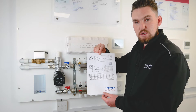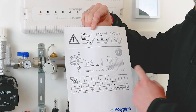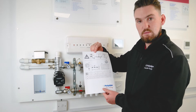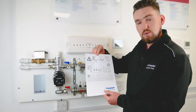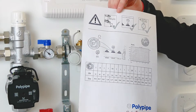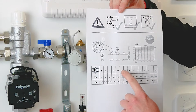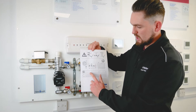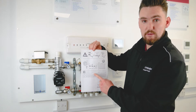On the conversion chart, we've got liters per minute along the bottom and the top row shows the notches and numbers which are engraved onto the valve. The middle row is liters per hour, which we're not interested in today. If you've had a design done by the Polypipe design team, it will tell you the flow rate for each circuit in liters per minute. For example, if it says two liters per minute, we find two on the chart and transpose to the top row — that's the notch after 10. Each notch represents a value of two, so two liters per minute is actually setting 12 on the valve.